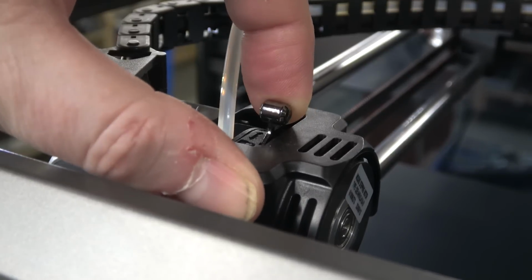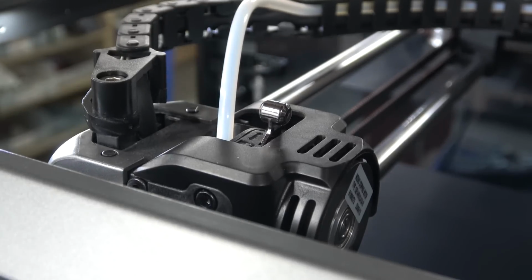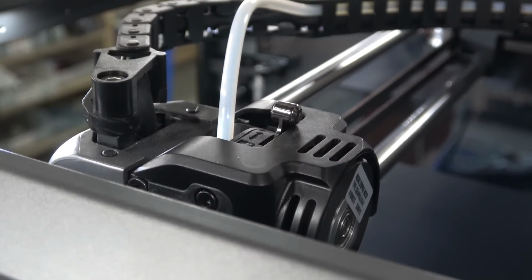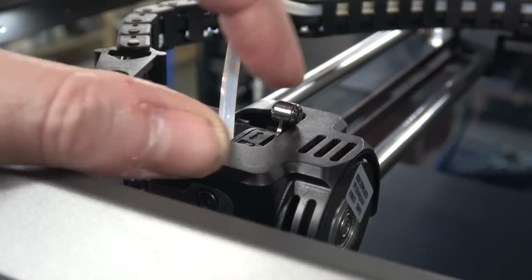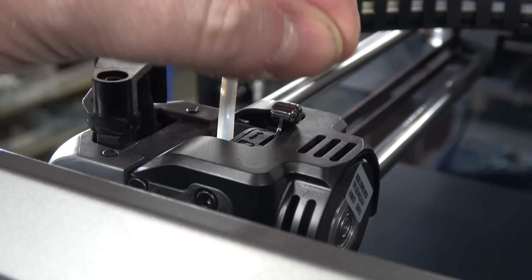Let's shift it into neutral and see if it still extrudes. It's not documented. It's just mentioned once. It says keep filament switch on when not extruding, but it's not on. It says lock and unlock. Extruding, nothing's happening. Switch to lock. Okay, so that must be the friction wheel clutch, so to speak. It probably engages the friction wheel with the filament. You know, I would grab that lever and open up the clutch. This appears to be basically the same thing. So if you're trying to remove or install filament manually, you'd probably want to set this to unlock, which would be in this direction. And then when printing, to the left.